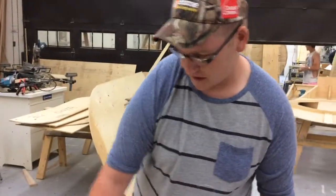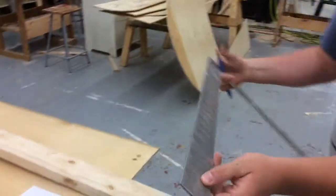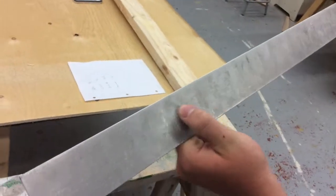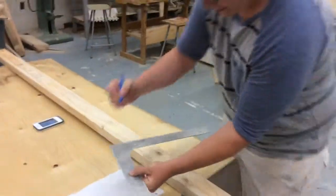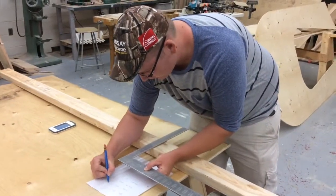And then your slope is a 6 to 12, which, if you look on here, there'll be your rafter table, which is all along the top number. And you'll need to find 6. And write down 13, 4, 2.